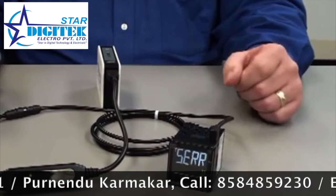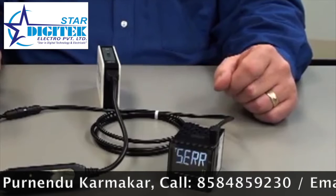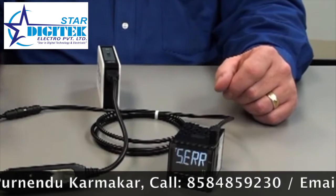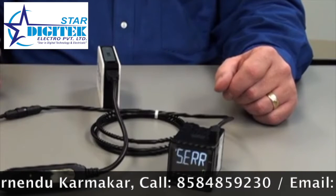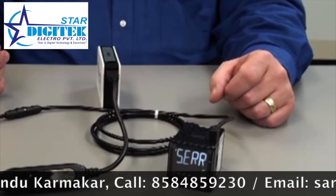Here, I will be using a USB power supply to power up the E5CC temp controller by taking the conversion cable and plugging it into the E5CC temperature controller. This feature powers up the temperature controller without the hassle of input power wires to the unit. All that is required is a USB power supply of 5-volt DC and a current of 450 milliamps max.